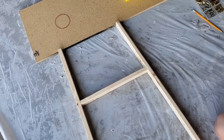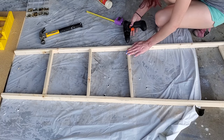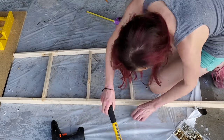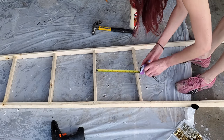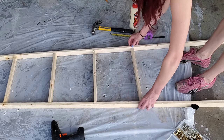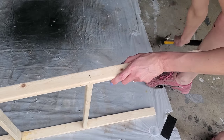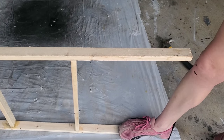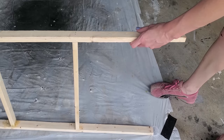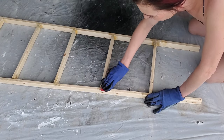What I originally did was start at the top, measure down 11 inches, mark off where I wanted my rungs, add wood glue, and then nail it in. You can see me struggling — trying to use my feet to hold one side of the ladder while nailing. I don't have a nail gun. What I really wish I'd done is just used wood glue and not worried about nailing at first, since wood glue is sturdy enough to hold it by itself. My suggestion: just use wood glue, lay it all out, and let it dry overnight.